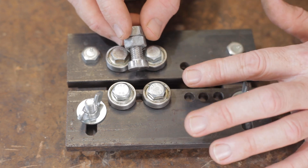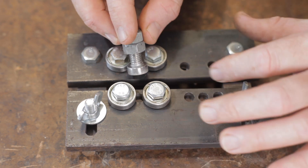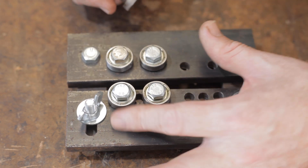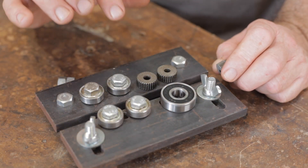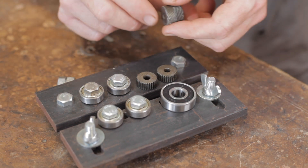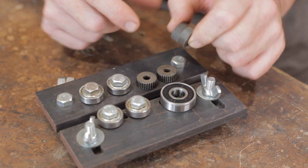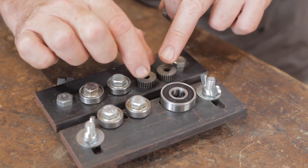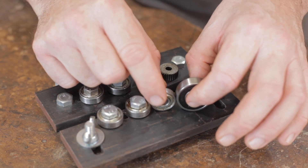For a second I thought that was actually going to work, but there was a bigger issue — I was tightening the vice up to try and get more of a knurling effect, and the tighter I got it, it broke these two bearings again. It's actually been a couple of weeks, and to try and get the jig up and running, I'm ditching the file. What I've done is bought a couple of cheap pairs of knurling wheels off eBay — I paid eight dollars a pair. These ones will do a diamond pattern and these ones will do a straight. I'm going to ditch the bearings on this side, bolt those directly on, and go back to a single but much bigger heavy-duty bearing on the other side.